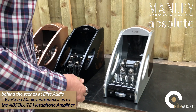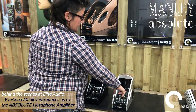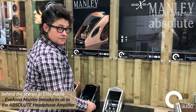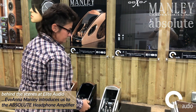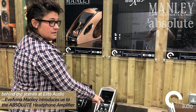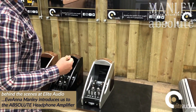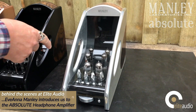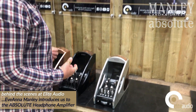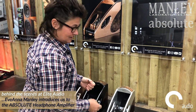This is a tube design using 12AX7s on the inputs. We've got 6AQ5s on the outputs — those are also known as EL90s. We are using new old stock RCA 6AQ5s here. Interestingly, a 6AQ5 is also electrically equivalent — but not pin compatible or size compatible — with a 6V6. This is a little baby output stage here, a little baby tube amplifier.